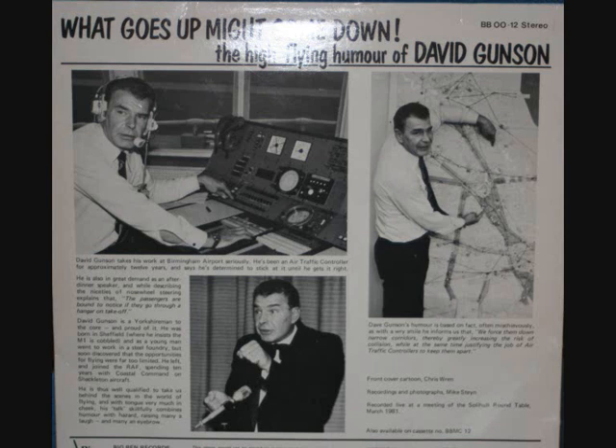The whole aircraft expands by one foot. If you could take the carpet up in the aisle — it's a very narrow aisle in Concorde — you would see that the floor is in plates and you can actually see them move. If you can see daylight, you should tell somebody. But they do move, and hopefully when we get to the other end it will shrink, because if it doesn't, we're going to have the longest Concorde in the world after three years. And there are just two instruments on Concorde you should know about: one is inside the passenger compartments in the top left-hand corner, and it clicks up to Mach 2 — twice the speed of sound — and everybody goes 'very good indeed,' because that's what they've paid £987 for. In fact, it's just wound on and it does go up to Mach 8 actually, but they don't want to show off at the moment. And the other one is inside the cockpit and it measures the skin temperature outside, because if that gets above 125 centigrade you have got trouble with a capital T.